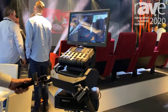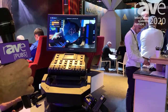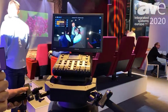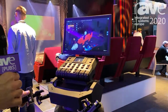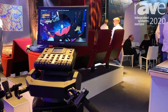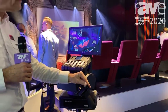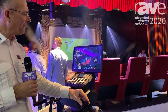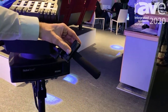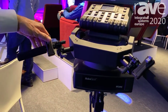Basically, this is already the idea behind it. Now we have somebody that can remotely operate the follow spot, so we can point it and follow the actor. A follow spotter does not only have to operate the movement — he has to operate the dimmer very often. So we have the dimmer on that fader, and on this side we have assigned the iris, which is also what a follow spotter does.